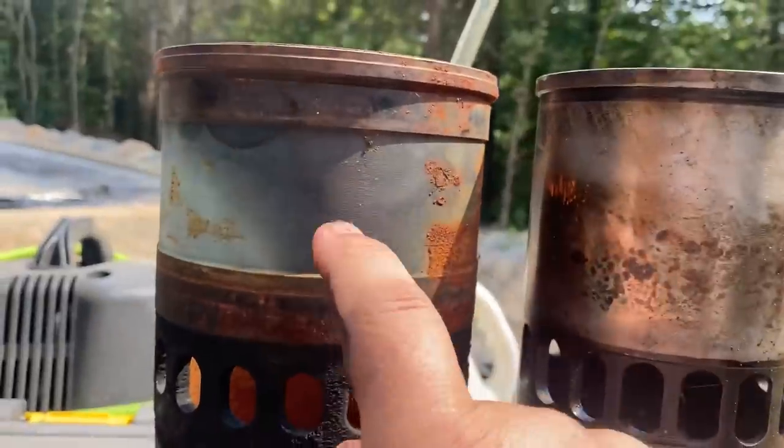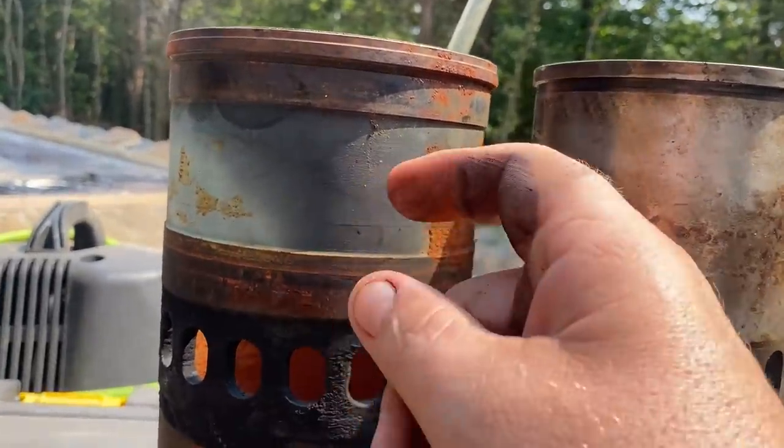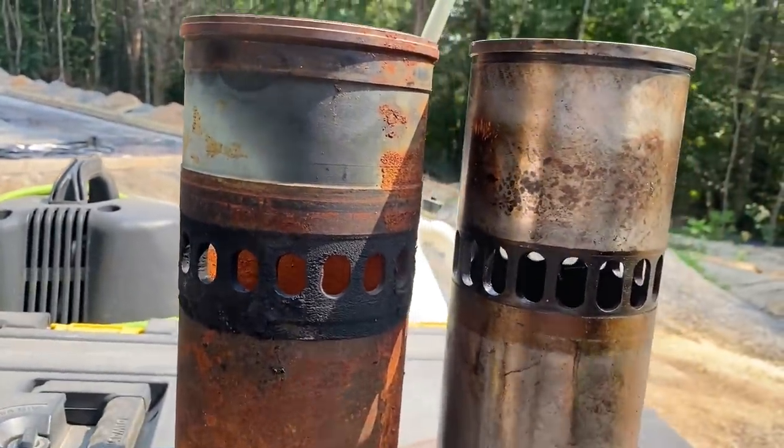But you also get cavitation issues if you don't use the right coolant. Basically, the coolant reaches the boiling point when it hits it and it explodes little pieces of metal away, is a kind of short way of explaining it.